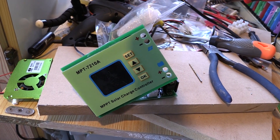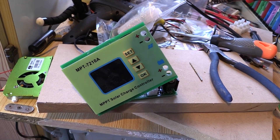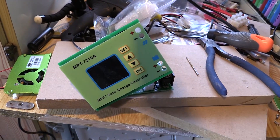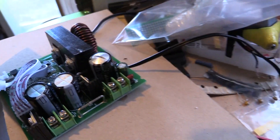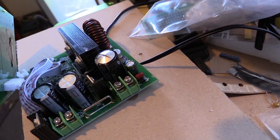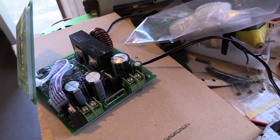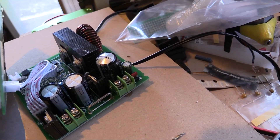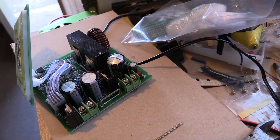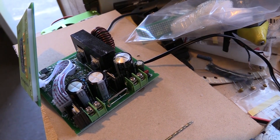The sensitivity of the cap must be just OK for the other unit, but having that very slight voltage increase caused the cap to blow within about 5 to 10 seconds after turning it on. I've pulled it apart and this cap here is not looking happy — that's obviously the one that blew. I've never seen a capacitor blow before, but it just went poof and a whole bunch of white smoke came out. So I pulled the fuse out and today I'm going to have to replace that cap.